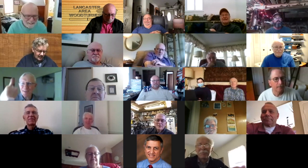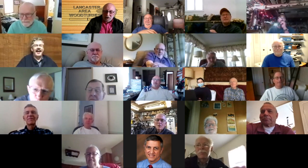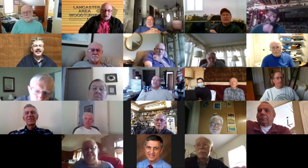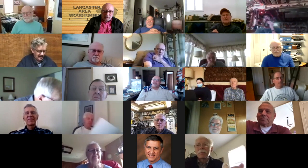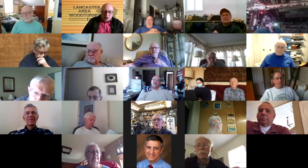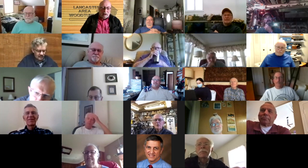Yeah, no kidding. Hey, John Kelsey, have you been doing anything other than taking pictures of wood turning? What I did, yeah, took me two afternoons this week to make a new center post between two double doors that open to the outside from my shop. The old people who lived here before me went down a couple of times and their sons had to kick that door in, so it was all smashed up. So I had some cypress from another project. I made a new door post, and since I don't keep a router or a table saw, I mean, I have a router, but I hate the things, I make things with rebates in their cross section by gluing up strips of wood.